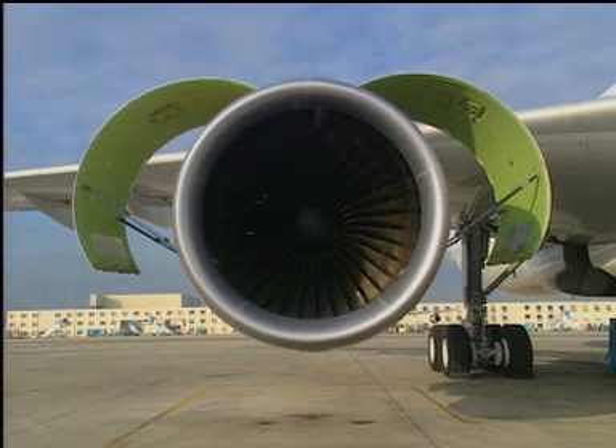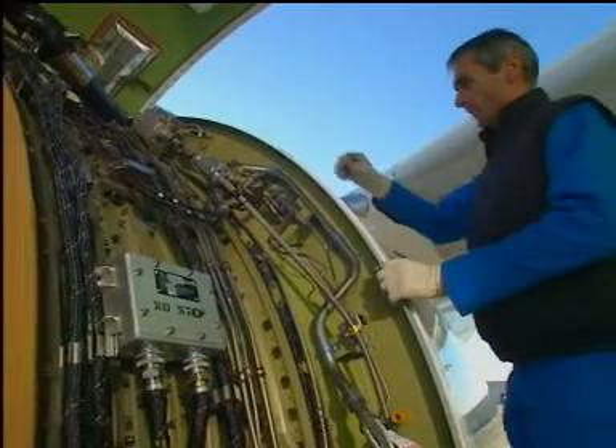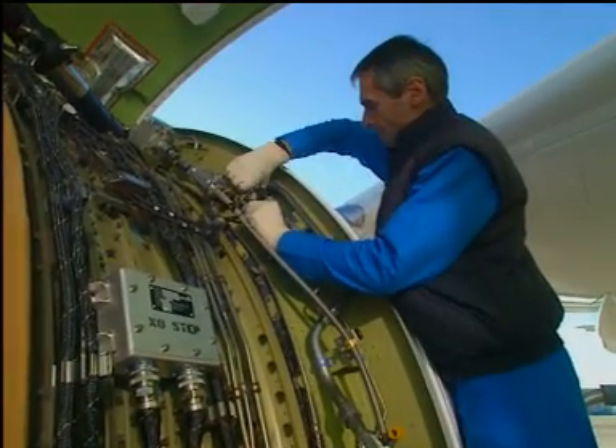You must first follow the safety precautions and prepare the aircraft to operate on engines. Fan cowl doors have already been opened. To apply this procedure, refer to the aircraft maintenance manual procedure. Disconnect the electrical connector for the directional pilot valve (DPV) from the stowage bracket on the fixed structure.